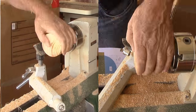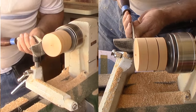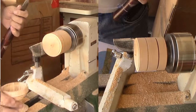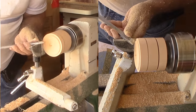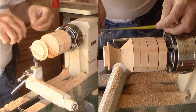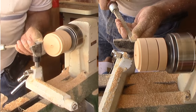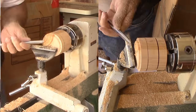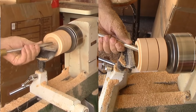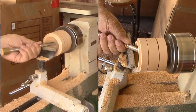I'm swapping the halves. Before hollowing I need to cut a tenon to match the mortise on the other half. Since this will be glued I'm not as picky with the result, but I still get a good tight fit. Then I hollow this half similarly to the first, using a spindle gouge and a round nose scraper, and finally a little trim to shorten the tenon.